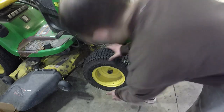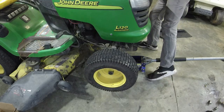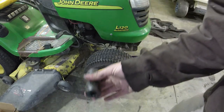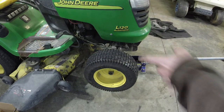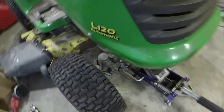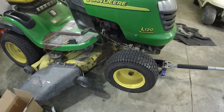I think this is a little bit better — a lot less play than what we had. The other side is okay; it had a little more wear but wasn't nearly as bad as the right one. That bearing I couldn't get off — I took a 15/16 socket and that got it out with a couple hits of the hammer. We're going to grease up the front end. I also bent the tab down on this side a little bit, so we'll drive around and see if that helps. Next thing is tackling this PTO wiring, and after that we'll be ready to finish up, clean it up, touch up the paint, and get it out of here.